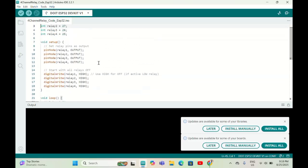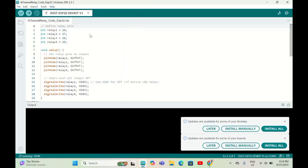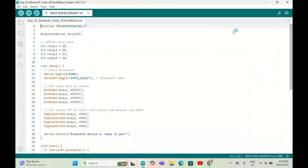I'm opening the correct Bluetooth code — not the non-Bluetooth version. This code includes the BluetoothSerial header file. We initialize a BluetoothSerial object, and in the begin function we set the Bluetooth device name to 'esp32 relay', which is what you'll see on your phone when pairing. We then define relay pins 1 through 4.